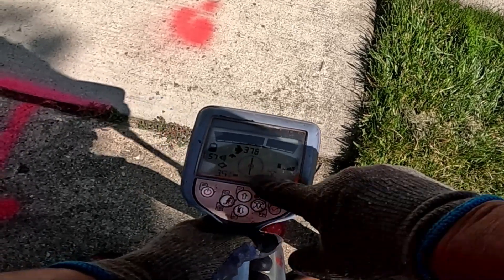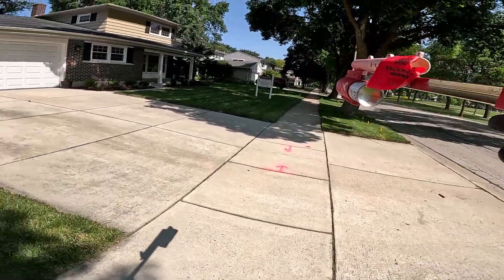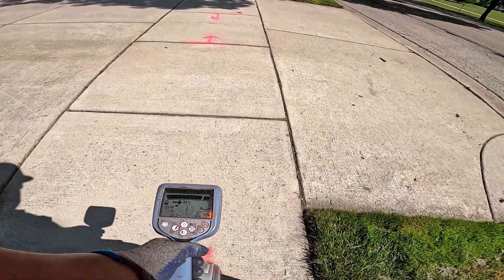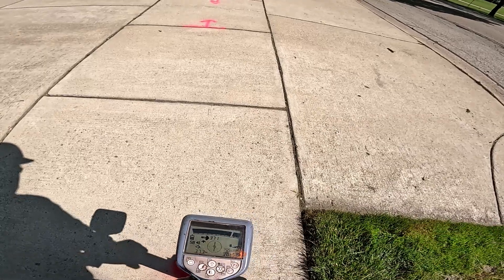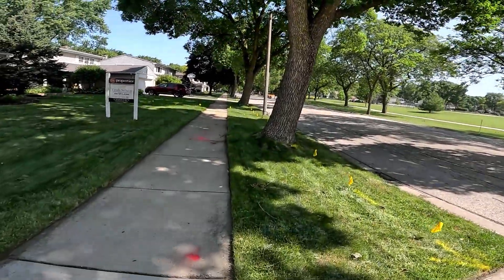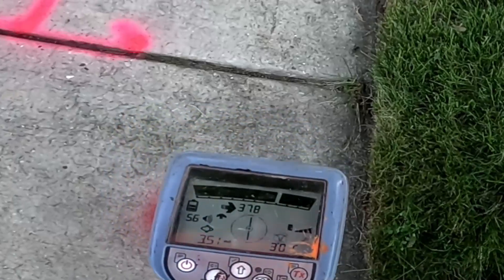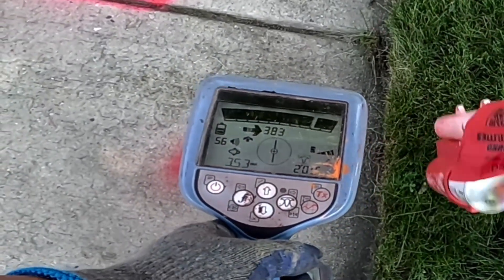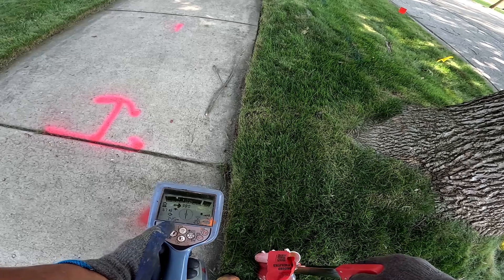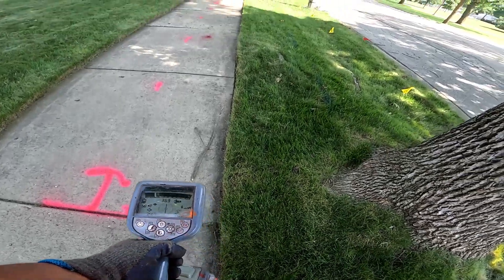My null is in line with the peak. The compass is nice and straight, and this directional arrow right here is pointing away from my box because my hookup spot is way down there. As long as my arrow points towards the current flow direction — which is going this way — I'm fine. Everything's in agreement and I got 3.5 milliamps, not bad being a mile away. So I know this is my target point right here.